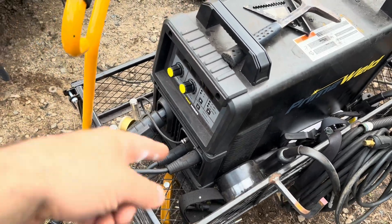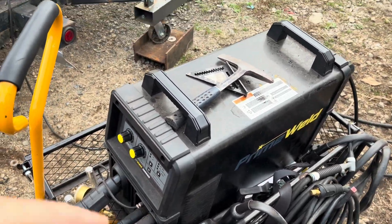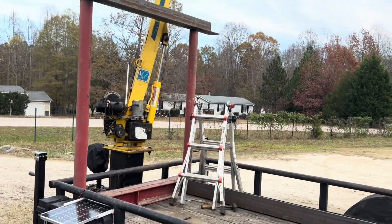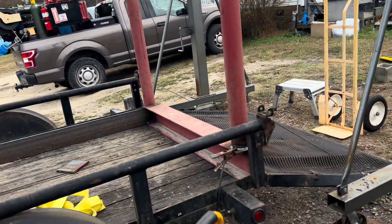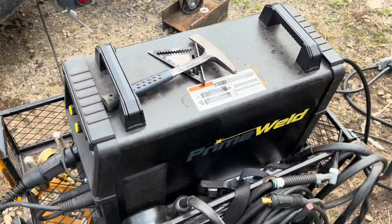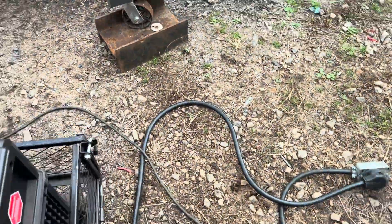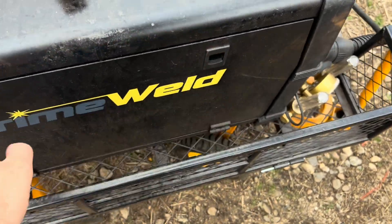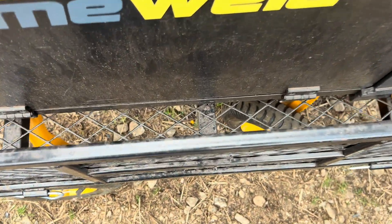This MIG 285 gets used for dual shield constantly — building stuff, doing three and four bead passes, big heavy work. I'm pretty sure that's basically what they designed this machine for, to run dual shield. I do have one of these little wire cleaner doohickeys on there. I don't know if it really makes that big of a difference, but I bought a pack of them and figured I'd try it out. There's a nice little settings chart inside. This ain't a brand new machine they just sent me — it's a used machine, dusty from sitting in the shop.